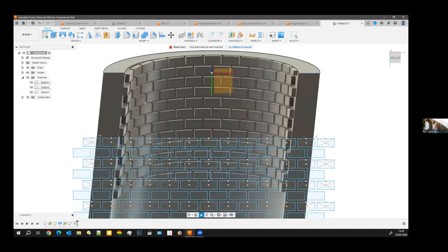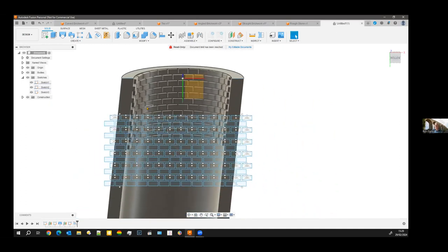And of course, you could sit down and calculate. You can say, right, okay, if I build this brickwork on an angle template, you can make it work. But the problem is it's difficult, because if you set the brickwork on an angle of 5 degrees and it works, it won't necessarily work for an arch that's slightly different in size, because the calculation will be different for each arch and the size of the arch, so it gets involved.